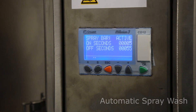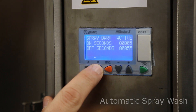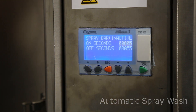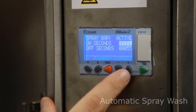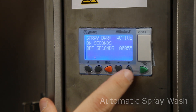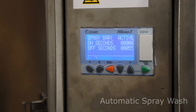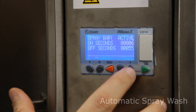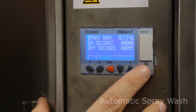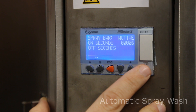Within the spray bar menu you can select whether you have a solenoid valve which needs to be activated, or whether you have a manual one, in which case it needs to be deactivated. You do this by pressing B and your signal changes to inactive. To revert back, press B again. To change the duration of the spray, activate it by pressing OK and change your values by pressing plus or minus, then OK to save. By default the spray bar will remain off for 55 seconds. To change this, move the cursor down, press OK to select, and then change your time. Don't forget to press OK to save the setting.